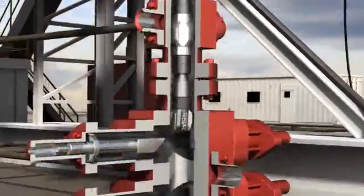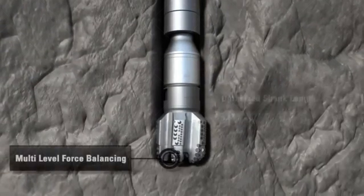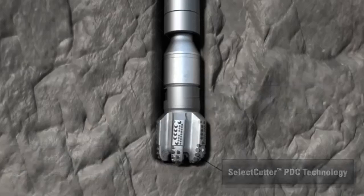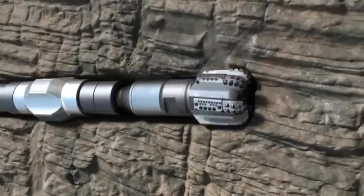With the right pump and the right jets, there is a large pressure drop at the bit face. This impacts the bore face and also causes shear thinning of the mud. This helps prevent bit balling. Properly designed mud will recover its original viscosity within a few feet and help carry cuttings to the surface.